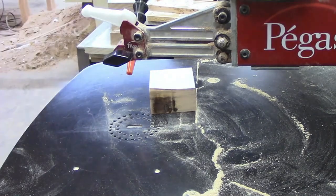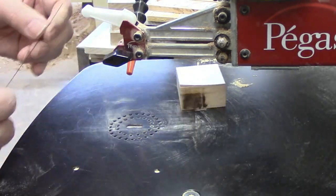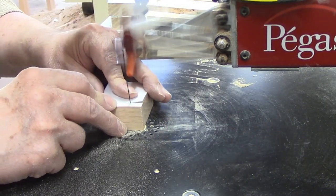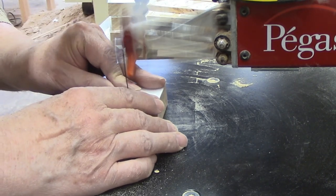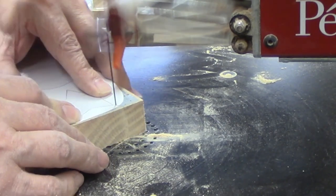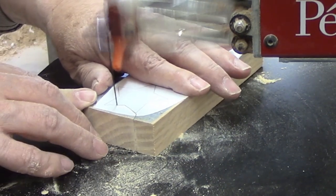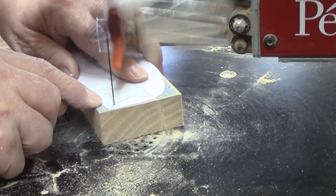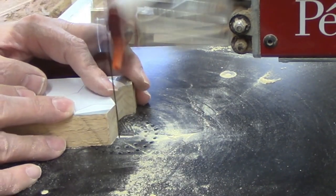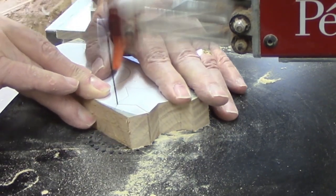I could feel the blade was getting dull as I made the third cut, and my sense of touch was not leading me astray — the blade was getting dull as evidenced by the burning left on about half the cut. Fortunately, this was on a flat surface, so I'll be able to clean it up with a little touch-up on my belt sander. I tossed that blade and put in a new one. I obviously had to start cutting the first point of the star on the outside edge of the wood, but unlike the square, there was no easy option for cutting the first angle. It was an obtuse angle, large enough to be an easy turn to the next side. I followed the line to the next turn, which was going to be an acute angle. I tried to make it in place, but went a little past the tip of the star, and the best way to correct the error was to cut to the edge of the material, then come back and sharpen the point by coming in from the outside.